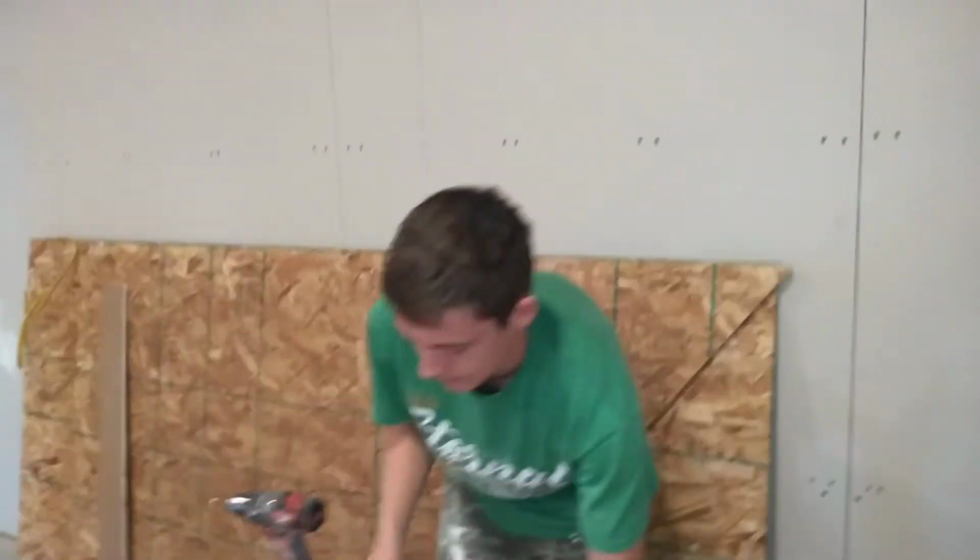Bang. Now, take your corner trowel, and you just go like that, smash that down a little bit, all the way down. Wipe off your corner trowel. Then you go back up with it. All right, so that's that.